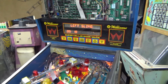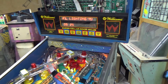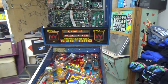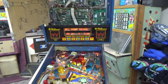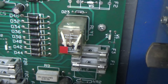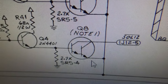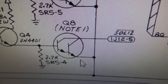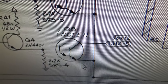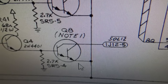With all of the bulbs replaced it's obvious what's going on - the C side is never coming on. It's playing the A, and the A and C side are the same coil. So our little relay that switches from A to C - I believe it's this one - is not working. We've got to figure out what's going on with that. Tracing back through the schematics, solenoid 12 is the line that turns on the AC relay, and it is controlled by Q8 in the back box.